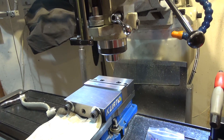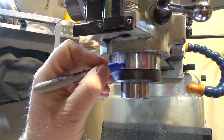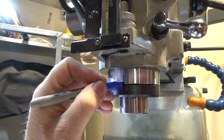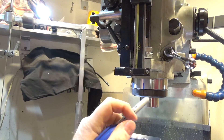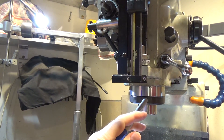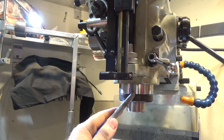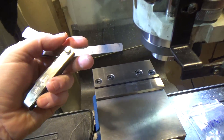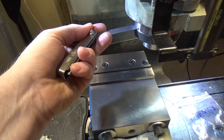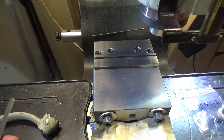I'm going to put mine back because it seems like the right thing to do, and a tight collet might benefit from that extra bit of locking force — but I'm sort of on the fence as to its necessity. First step: I'm marking the column and the locking nut on the bottom of the quill, so I can take this locking nut off and put it back in the same place. I'll use a feeler gauge to measure the gap — for mine it's about 0.016 inches (0.4 mm); the 0.017 doesn't quite fit. So 0.016 is what I need to come back to.